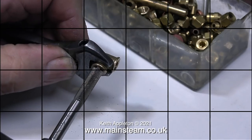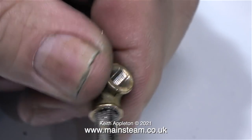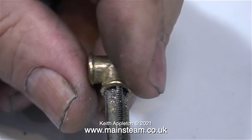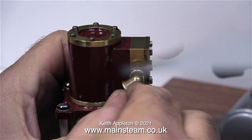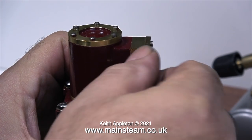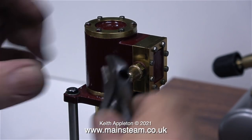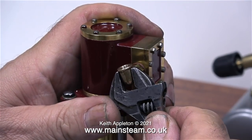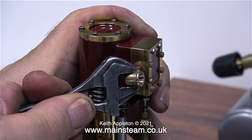Time now to fit the valve to the vertical engine, also known as ISIS. Once again I'm re-threading the elbow with a quarter-by-40 tap. It's worth it though because I think these very small cast elbows look really neat in a model steam engine application. On this engine I left the fiber washer in place because it was in the right position, and you will notice I'm not putting much pressure on this elbow — too much pressure will shear off the fitting.